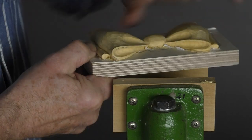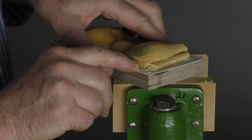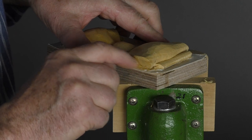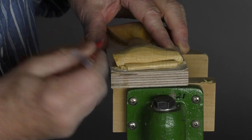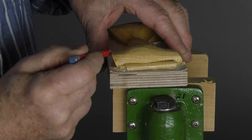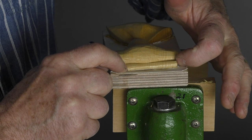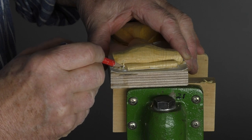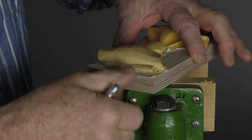If I look at the other side here, you can see how much it's been undercut. You see, quite a bit. But to lose weight, we could take more away from that. But that's a later thing. Here, on this point, this undercutting there, I've continued across this one as well. So both the top and the bottom of the ribbon, and the back ribbon, shall we call it, have been undercut and set in, and we should have come round and stabbed into the background here, so that when we cut that paper, this will pop off.